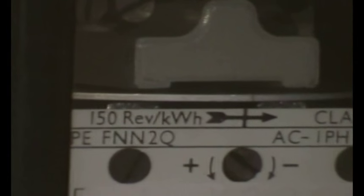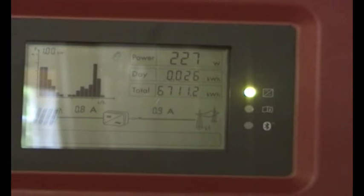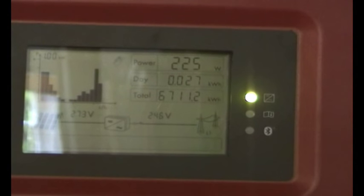It's a matter now of just monitoring this situation. If you remember we said about 300 watts - well for some reason this is fluctuating a bit. Maybe the maximum power point tracker is having a slight bit of difficulty working out what's going on, but it's working. So now we know that you can use a wind turbine permanent magnet generator and a solar grid tie on a water wheel.